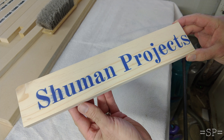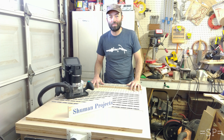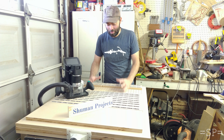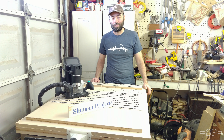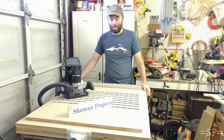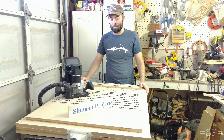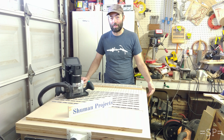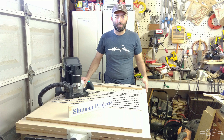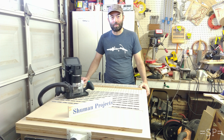Super happy with how that held together. Wrapping up — I'm really happy with how this turned out. It's one thing to watch videos of other people build one of these, but it's another thing to actually see your piece held down with your shop vac. Some things we might change: size — it's big, designed to sit on top of the table saw, but it ends up being really heavy, so I might try making one that's a little smaller and easier to move. You can also try swapping out the ¾ inch MDF for something thinner on the bottom, since we don't care so much about it being really flat just to seal. I'm also thinking about putting some solid wood on the sides so that when it's moved around it doesn't get banged up. I hope this was interesting and I hope you learned something — love to see what you're making on your CNC. Please like, share, and subscribe if you want to see more from Schumann Projects. Thanks a lot.